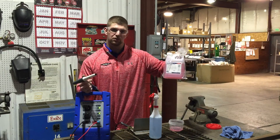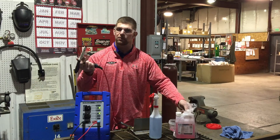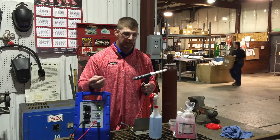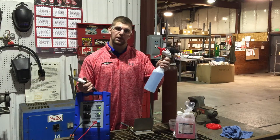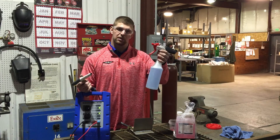The fluid I'll be using today is the TB25. TB25 is a mild phosphoric acid — it's like what's in Diet Coke. It's not hazardous to your skin or anything like that. And because it is an acid, you have to use a neutralizing solution. The neutralizing solution I'm using is TB40.